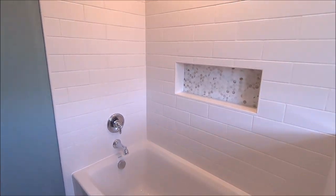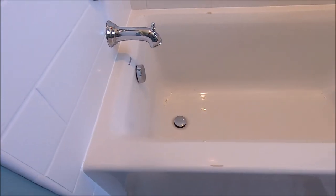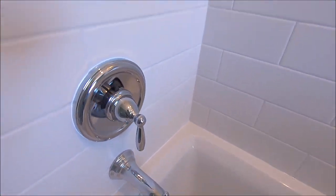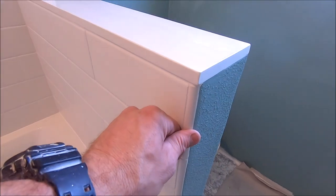The shower turned out clean, modern, subway ceramic — 4-inch by 12-inch for the field wall tile. Walls are flat, plumb and square, full tile starting at the bottom of the tub and ending at the bottom of the niche. Of course, we installed a new tub, valve, tub spout and shower head. We have silicone around the perimeter of the tub. 50% offset was the layout. Here's our pony wall trimmed out with ceramic Jolly, capped off with manufactured quartz. We have our Jolly trim over here as well.